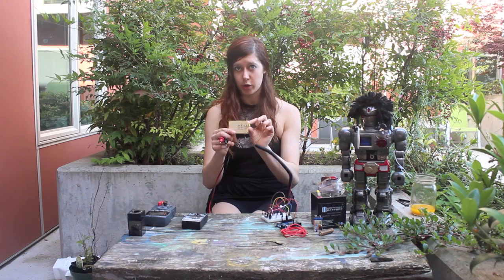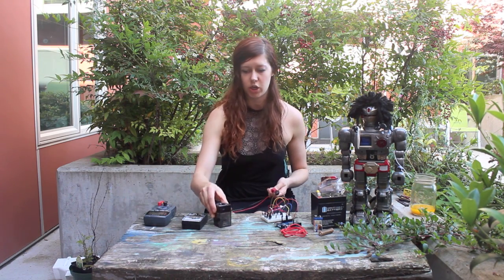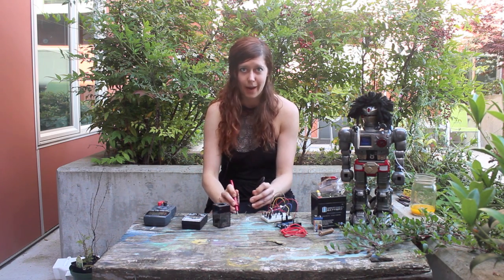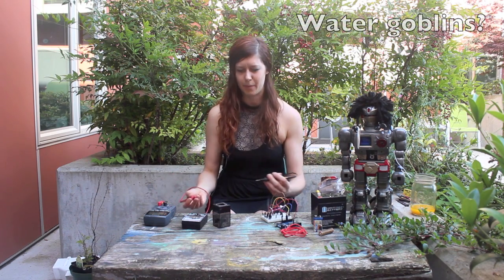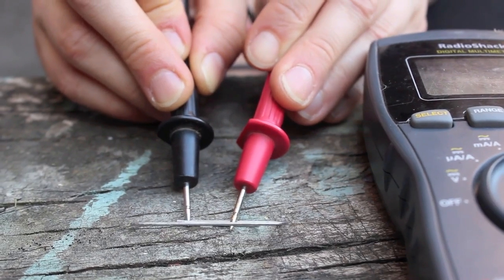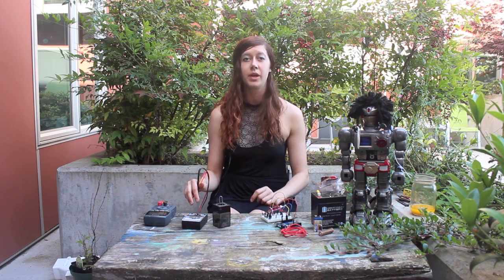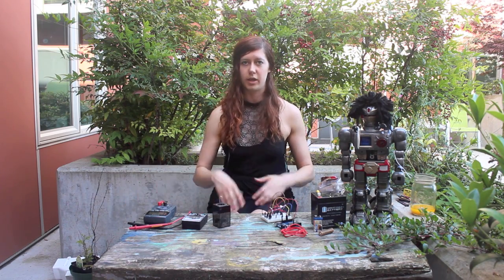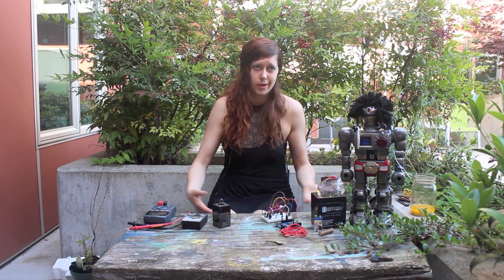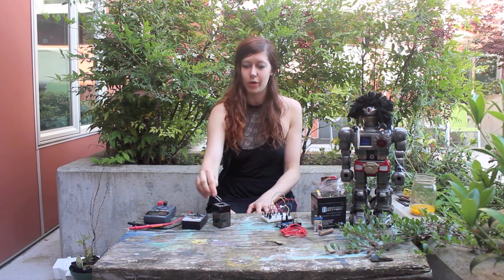You can also use it to check your soldering joints on PCB boards. And it's also really handy to check if different materials conduct or not. If I check the wood table, nothing happens — wood doesn't conduct, doesn't beep. But I check the paper clip and it beeps. This is really useful because sometimes paper clips are coated with plastic, or if you want to upcycle different objects, you can check if they conduct electricity using the continuity setting.